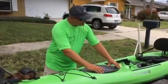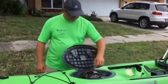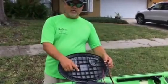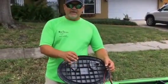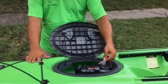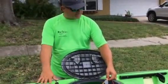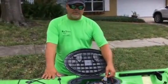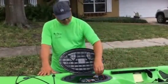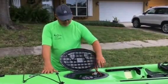This boat has the fall locking hinge caps on it. We open up the front and we have our battery cables — it fits a group 24 deep cycle marine battery, 101 amp hour. We also place a 50 amp resettable breaker on here in case you get into any weeds and the motor blows. You don't want to blow the motor or overheat the battery, so this will pop the little breaker. Once it cools off you just push the button and reset — very important item.